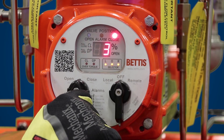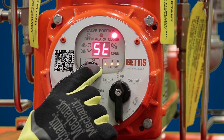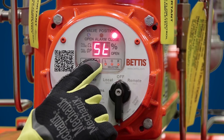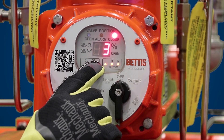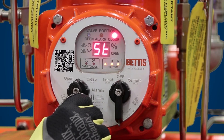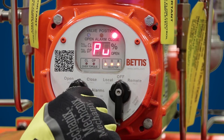Typically you don't need to change any of these settings in self calibration. Hit yes and you'll see some of the parameters. The first parameter you'll see is ST — this is your cycle count. Right now it has three, which means your actuator is going to stroke open and close three times for self calibration to help set the limits. If you want to increase the number of strokes, go to no. If three is acceptable, hit yes. We'll leave it at three and hit yes.